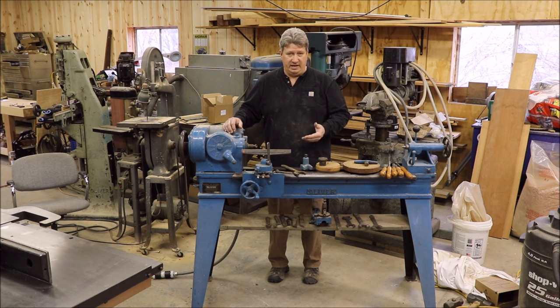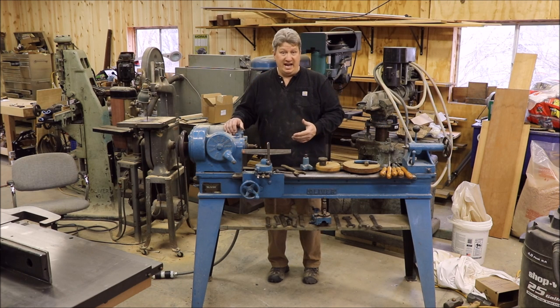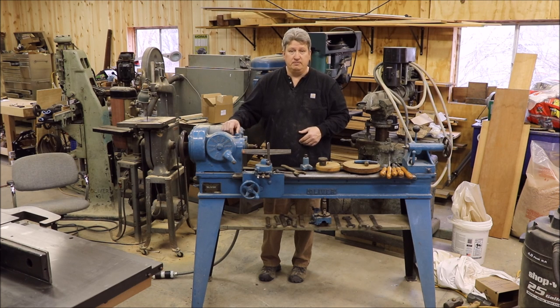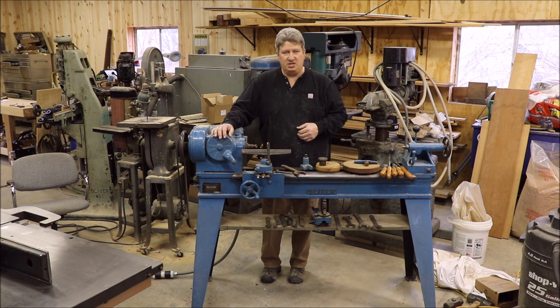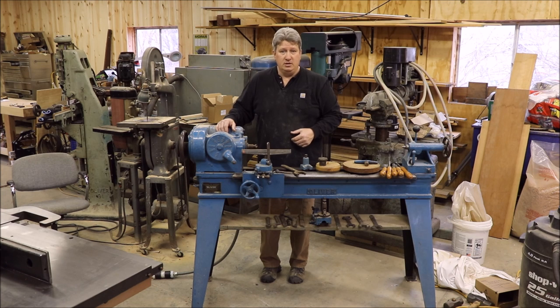They're an outstanding lathe, but they're considered a spindle lathe — what I mean by that is they're made for turning long, skinny objects. I want to do that because I've got quite a few old vintage chisels purchased at flea markets and garage sales and at Arnfest swap meet, and I want to make new handles for them. But I also want to turn bowls. This has a 12-inch swing on the spindle, and that's a nice medium-sized bowl. Looking at this dial here — this is the Reeves dial control — this lathe starts out at between 800–900 RPMs and goes all the way up to about 3,000 RPMs. That's really fast for a bowl — it's a good speed for a spindle, but for a big bowl, a big rough hunk of unbalanced wood, that's just way too fast for a starting speed.